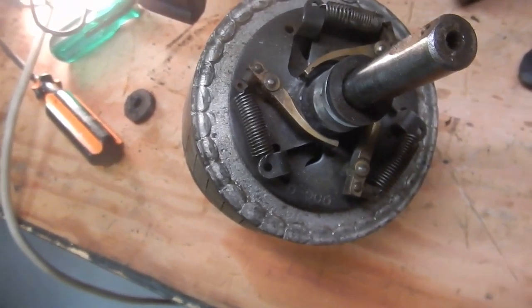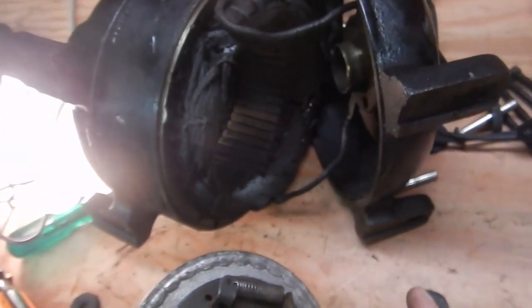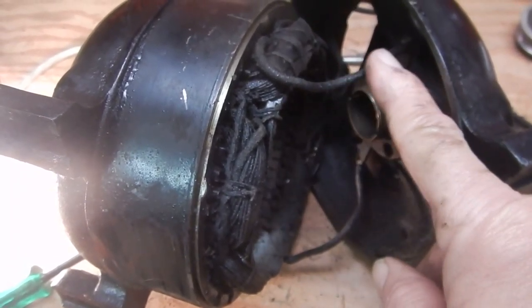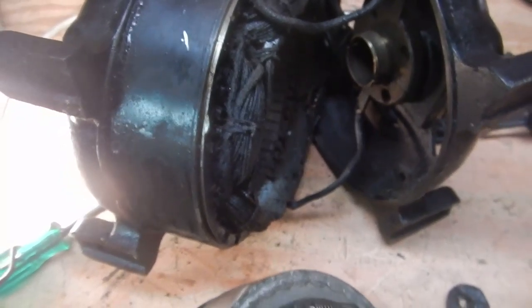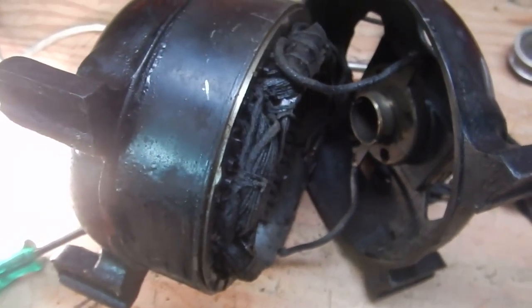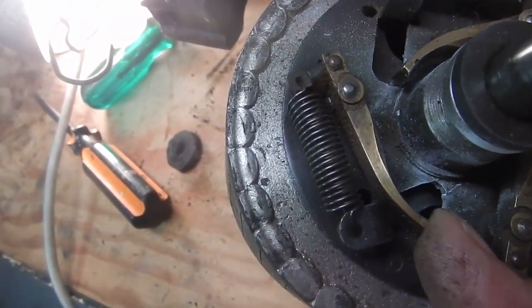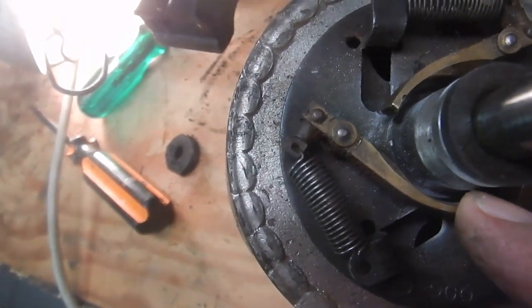To make this project easier to work on, I pulled the armature right out of the motor. It's a little tight, but you can get it out of there. You've got to be very careful though — this wiring is old, it's brittle, and you don't want it breaking away. You're going to have a real problem especially up here where it goes into the windings, so be careful as you do it.